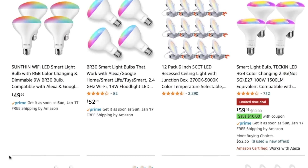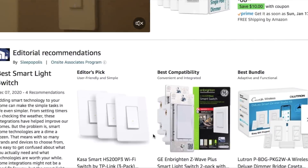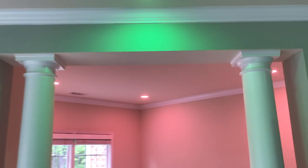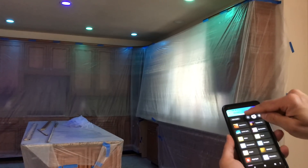Also, this is burgeoning technology. We're seeing a boom every year of new companies jumping into the market, presenting new lights and switches and features. And while they often tout their compatibility with existing technology, it's not always bug free. For instance, Harrison's clients had a terrible time with some of the alternate brand switches that were supposed to control the lights. These products fell in the Friends of Hue family, which means that they're compatible with Philips Hue's excellent color changing lights. But real world testing in several rooms revealed numerous flaws — lights wouldn't dim like they were supposed to, or there might be a serious lag between switch operation and the light activation. And router outages could cause the switches to essentially lose their programming, requiring reprogramming in the app each time.